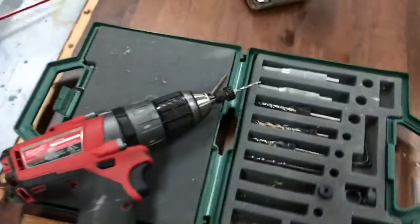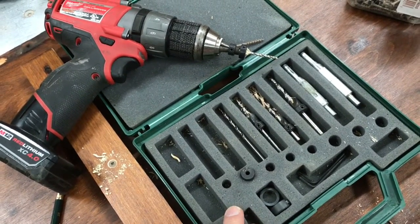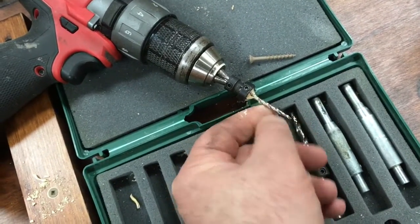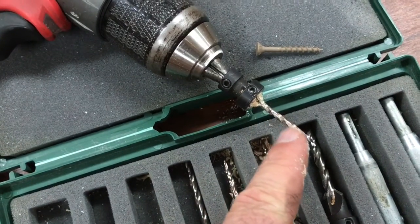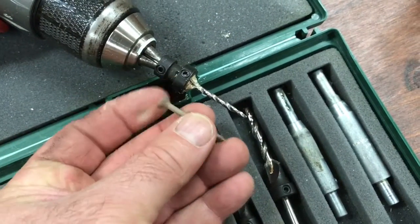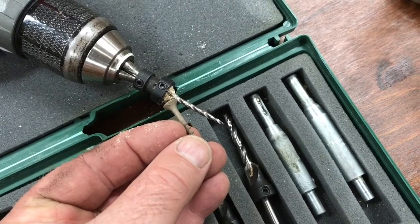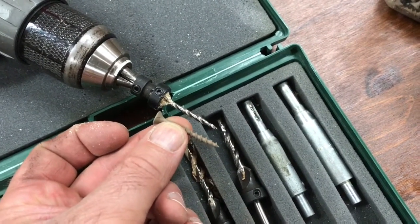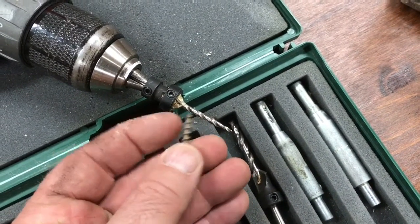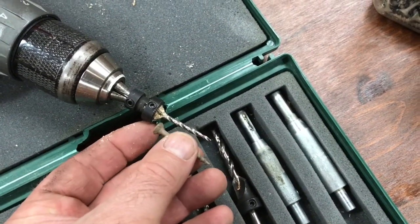It's kind of an adjustable bit set. I have a whole collection here. I happen to buy this from Lee Valley Tools, but this is the one I used. I don't know if you can see here, but the drill bit itself is tapered, which is useful when you're driving wood screws because it creates a wider hole up here so that this part of the screw and the top part of the threads don't grip in the first part of the hole. But because the drill bit tapers, the threads of the screw down here get a grip in the wood. So that's one interesting thing going on.